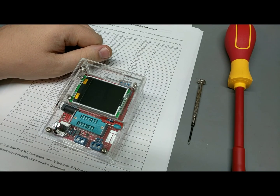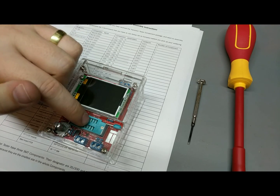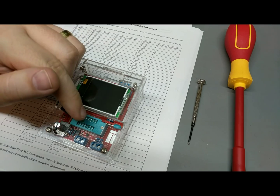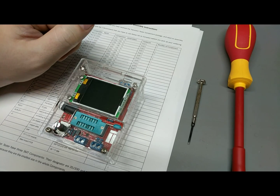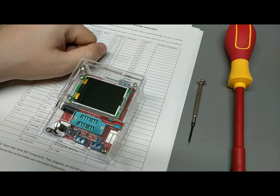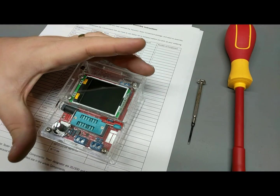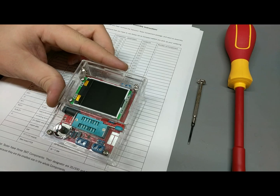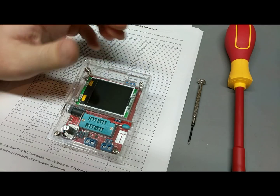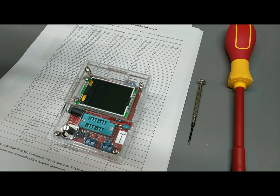All right. So I need to make a 3-point connector. I'm just going to grab 3 wires, solder them together, so then I can jam it in there and start this self-calibration. And I think it does need a capacitor, so I want to try and find a near enough value that it needs in order to do its self-calibration. Then we can start testing with the arrangement of components I can find laying around. Okay, so let's do that.